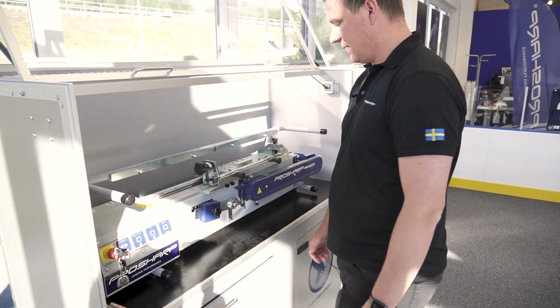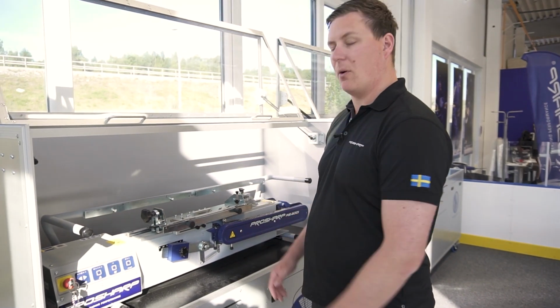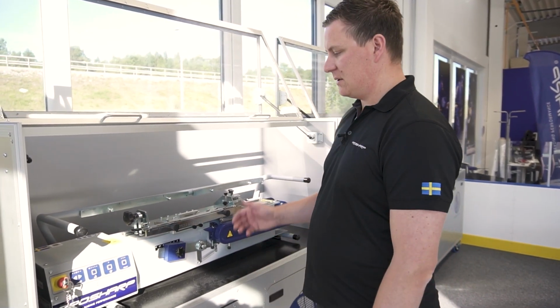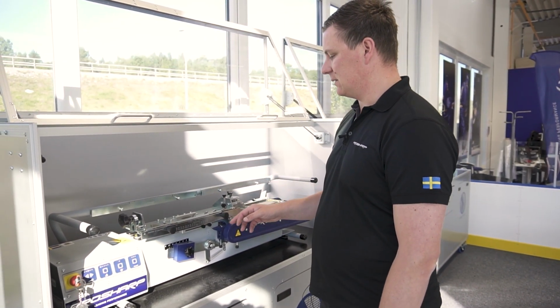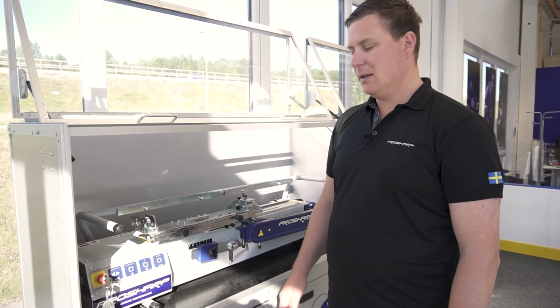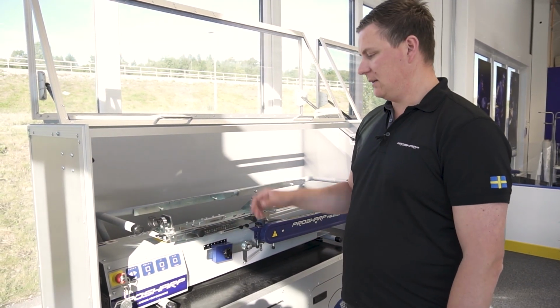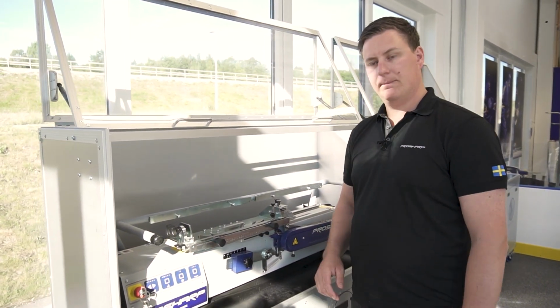And when you're satisfied with the height of the guide roll, we start profiling. And then we're gonna sharpen until the guide roll is rolling under the whole template. Then we copy the shape of them to the blades. Then it's time for hollow.